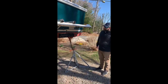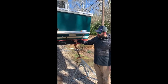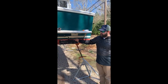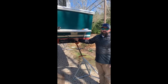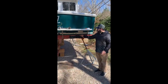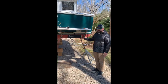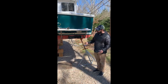Paint those every season, clean them up. If your boat is going to live in the water, you're also going to want to utilize the auto clean function that's in the system. Each system has an auto clean function. You turn it on and pick a duration anywhere from 24 hours up to once a week, twice a week, or three times a week. Basically what it's going to do is bring the blades down, cycle them — there's a scraper on the back side that's going to remove all the growth off the blade, keeping those units nice and clean.